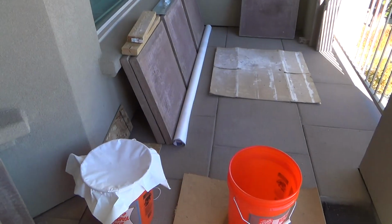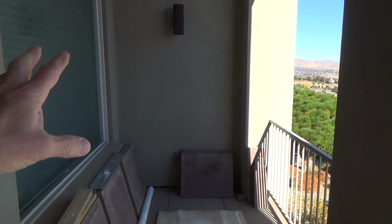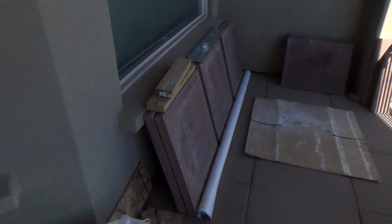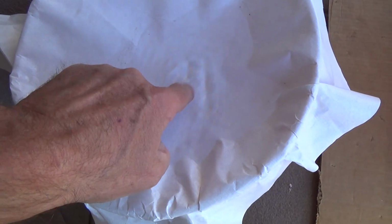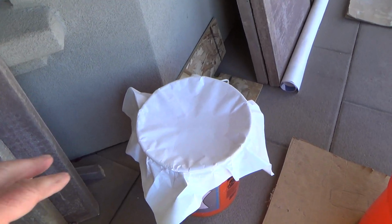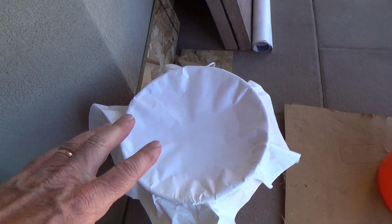And I was reading on it. It gives you an air barrier and a water barrier, specifically when you're installing it on walls before you install stucco, let's say, or before you install exterior siding, stuff like that. And I'm actually doing a water test. They said it's not waterproof, but check this out. I've had this water right here on top of this bucket for 2 days, and I've already done one test for 1 day. I pulled it back up. The bucket was dry as a bone, and I'm letting this set for another 5 or 6 days.